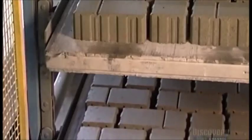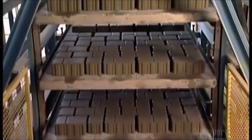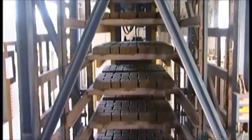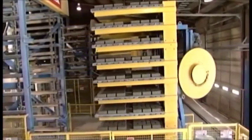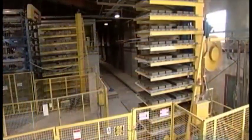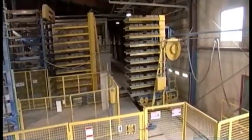The press boards filled with pavers slide into a rack. A hydraulic chain hoist lifts each board into a large holding rack. A special moving wagon called a finger wagon picks up all the boards from the rack in just one move. The electrical wagon moves along a rail to a curing kiln, where it's almost 38 degrees Celsius.